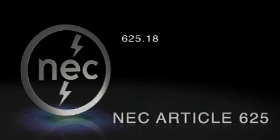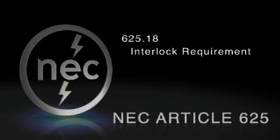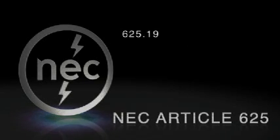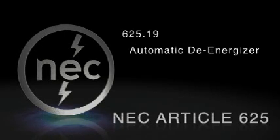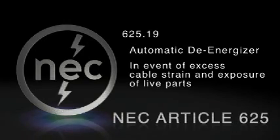625.18: The EVSE shall provide an interlock that de-energizes the electric vehicle connector and its cable when the electrical connector is uncoupled from the electric vehicle. 625.19: The EVSE, or cable connector combination of the equipment, shall be provided with an automatic means to de-energize the cable conductors and electric vehicle connector upon exposure to strain that could result in either cable rupture or separation of the cable from the electric connector and exposure of live parts.